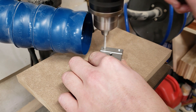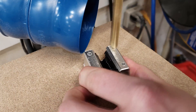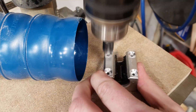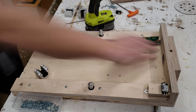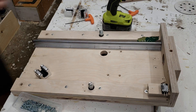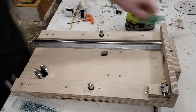The U-shaped linear bearings that came with my new rails don't have through holes, which is my preferred mounting method. So I had to drill out each hole and countersink on the back side. For mounting the new linear rails, I first lay down the spacer — which is actually the old linear rails — then shove a piece of cardboard near the top, as that was the exact thickness, about 20 thousandths, that I needed in that direction to get everything square.